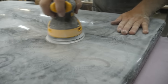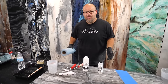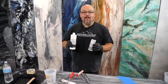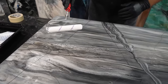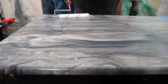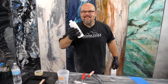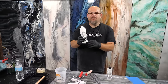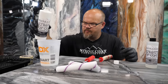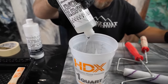Don't forget to sand the surface with 220 grit sandpaper and wipe the dust. I also used a little bit of acetone to wipe any excess dust to ensure a clean surface. Our 24 ounce kit is designed to do a 40 to 50 square foot kitchen. A little goes a long way, but what I like to do is slop a lot of material right in the center of my piece, use my wet roller to spread it out, and then come back and dry roll it. I don't start right on the edges — that's a pro tip for consistency. Be sure not to let the contents of part A settle; there is a matting agent that gives you that natural finish, so thoroughly mix part A — you can pour it all out into a bucket, mix it and put it back with a funnel, or just shake the bottle and agitate before pouring.